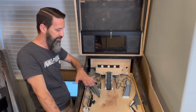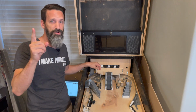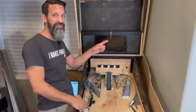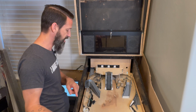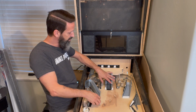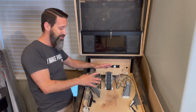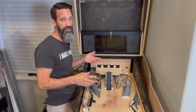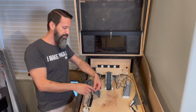That's important because when MPF starts up, before you even hit the start button, it just starts up and initializes itself. It sees a stepper motor, and if this switch is not closed, it's going to assume it's not in the right position. It's going to start turning that stepper motor in the direction we define, either clockwise or counterclockwise, and it's going to turn until the switch closes. Okay, and once it closes, then it's going to say, okay, we must be in the right position. So it's assuming you have everything set up properly, to where when that switch closes, you are in a good position to start. And then it's going to allow you to actually push the start button and start a game. Okay, so again, homing mode switch.